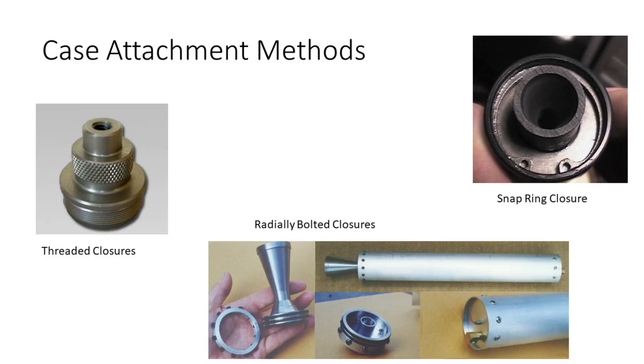There are several ways to react this 4,700 pounds of force from the end caps into the case material. Most commercial rocket cases use threaded sections on the ends for ease of installation and assembly, but this requires significantly more machining skills to make, and also requires that you have a machine large enough to accommodate your case.